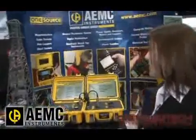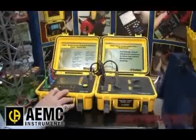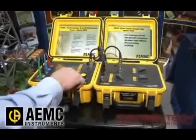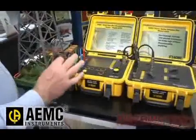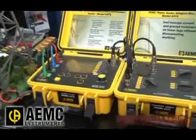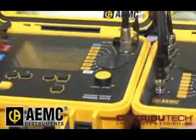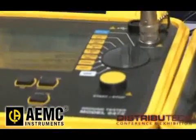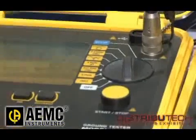But what are some of the other functions and features? Well, this is a high-end ground tester. We can check bond resistance, so we can check the quality of the resistance anywhere on a tower or anywhere on any grounding system. We can do the traditional three-pole fall of potential test, where the operator drives three rods in the ground and measures the ground resistance of any system — it doesn't have to be a tower. That's a standard function.